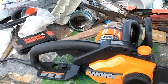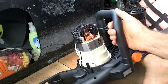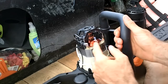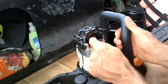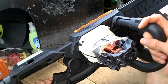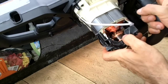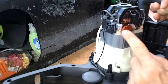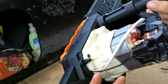So yes, let's void the warranty. The motor definitely runs on AC or DC because it has electromagnetic non-moving parts and electromagnetic moving parts. Every time the current gets reversed it affects both of them — you add a negative, it makes a double negative, and it stays positive, so it'll always spin the same direction. It looks like a good motor — it's got big fat brushes that should last a while, a nice ball bearing in the back, and all the electrical connections are quick connectors, which makes them easy to remove if needed.